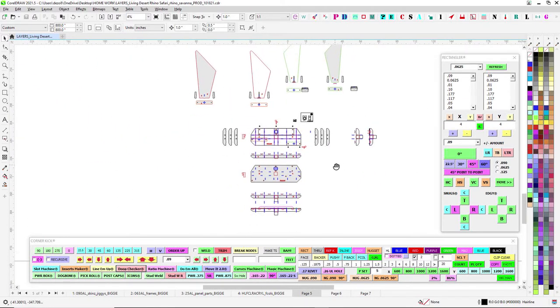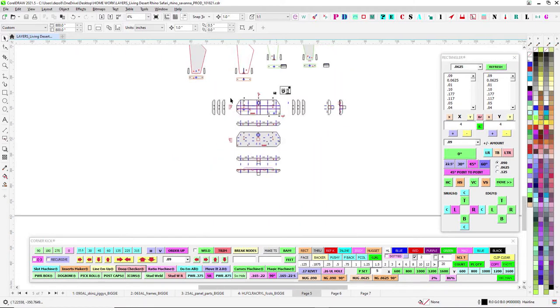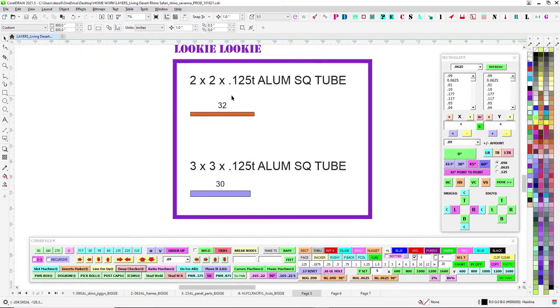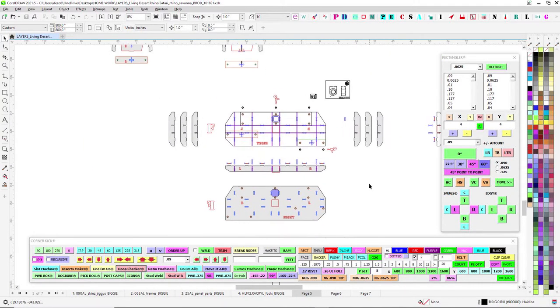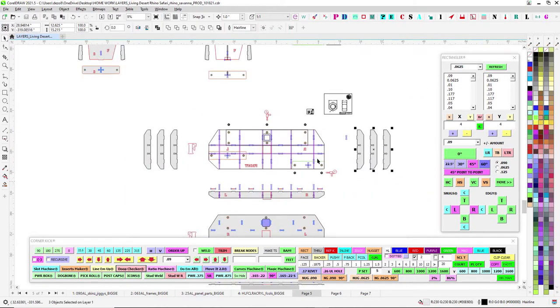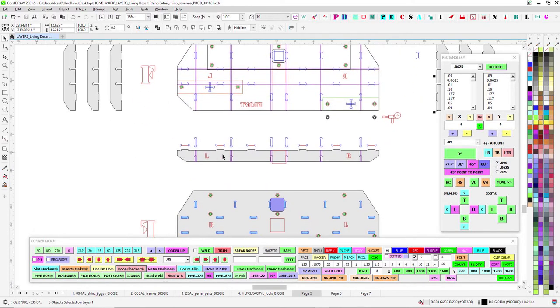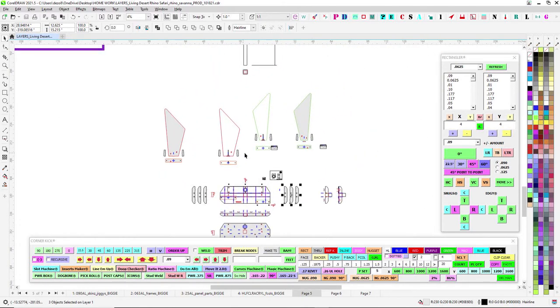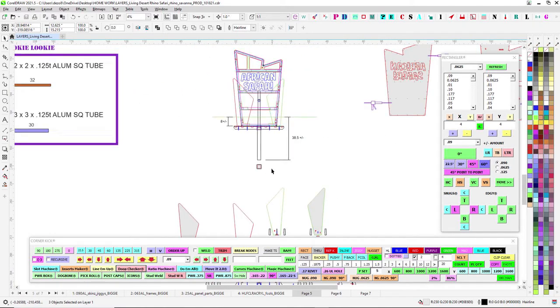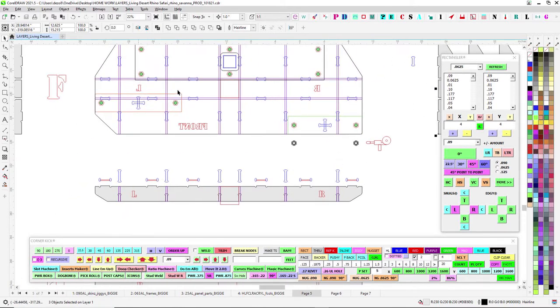Get the rabbit ears taken care of while we're on quarter inch. This is going to be like a giant mjolnir - you've got three by three, there's your cut. You'll have a 30-inch piece of three by three and a single piece of two by two for up there. Looking at these mjolnirs - you'll have six of these guys. They're exchangeable and symmetrical - these are the verticals or horizontals. Then you'll have two long longitudinal ones that run, which creates a little pocket. You're going to slide the three by three right into that pocket and burn it. These are all interlocking.